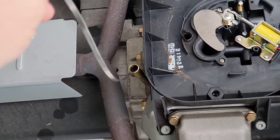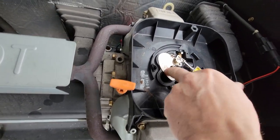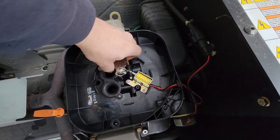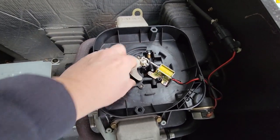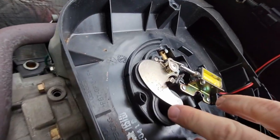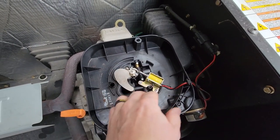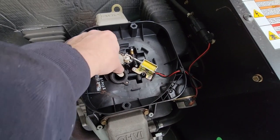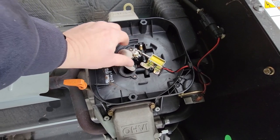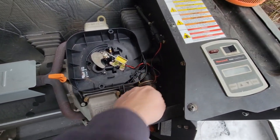Let's see if our linkage here is okay — it's smashed down all the way. I usually lift that up just a little bit so it doesn't actually touch the plastic. You don't want to do it much because you want it to do its choke mechanism, but you just want to keep a little gap to help keep it from freezing into place. When it gets down to zero degrees it tends to stick. That's something the factory told me years back and I just always do it.